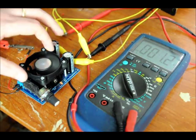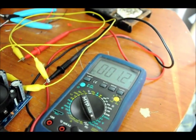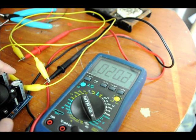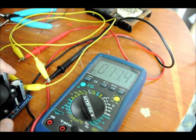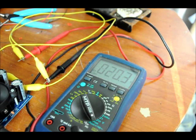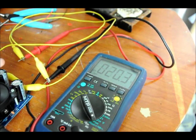Fan works! Our output is 1.2 volts, which is the lowest setting. We've got about 22 volts on the input. Because we have 22 volts on the input and are only seeing a maximum of about 20 volts on the output, that's because there's a voltage loss across the bridge rectifier circuit — a few volts will be lost there when using DC at the input. But now you've got a big bulky power supply for your motor circuits, well heat-sinked with a nice fan. If you're ready to drive some actuators or heavy loads, this is your baby. This can be used for tons of different applications. Thanks for watching everyone — I hope you enjoy it and have a lot of fun building it.